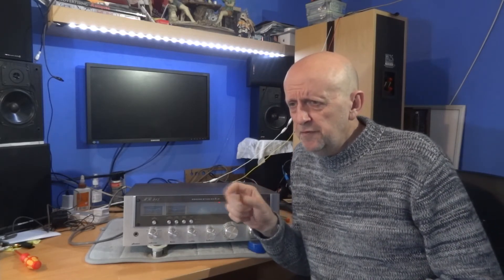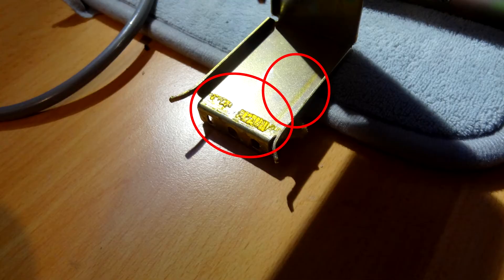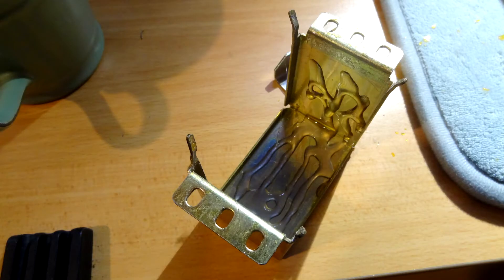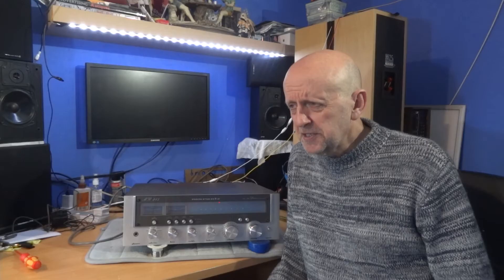I think they do have to do that in some cases. So now I'm going to remove the old glue off of the casing — it's like honeycomb, so it just kind of pings off, it scrapes off, it comes off fairly easy. It's all nice and clean now. So what I'm going to do is add the new glue to the outer casing and to the bottom plate — I'll tell you the glue at the end and show you a picture of it. So that's all nicely glued now, plenty of glue on there. I'm going to put the outer case on the bottom plate, push those four little clips in nice and tight and leave it for a day to dry.